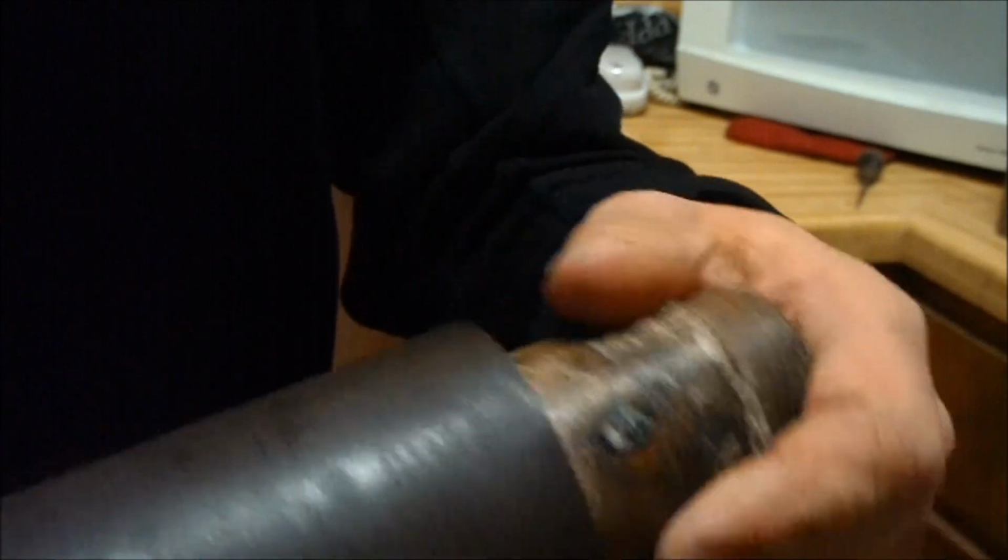So this is the casting that came out of the tube. This is the mold casing or tube, the outer casing, whatever you want to call it. This is the rough casting made with original Thomas A. Edison National Phonograph Company wax from circa 1898. We have it on the wooden core. We'll leave it on there for a little bit. This is to prevent warpage. It also reams it to a size that will be useful. But as you can tell, this blank turned out very, very nice.